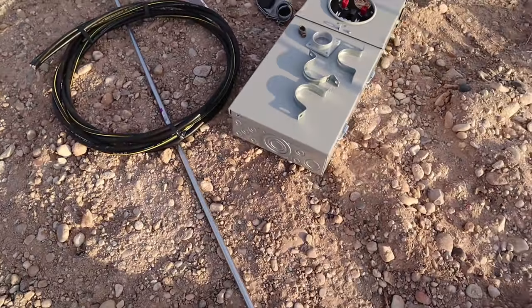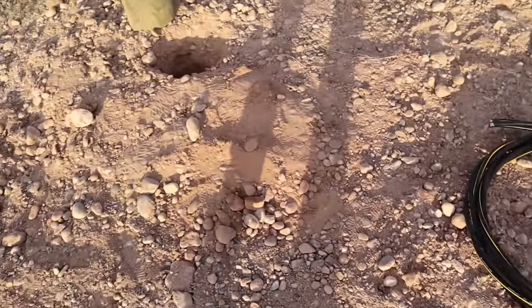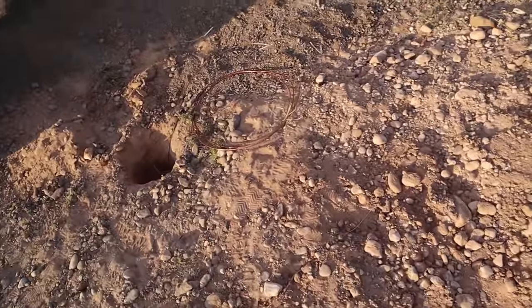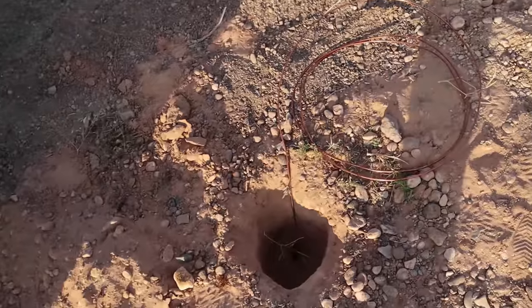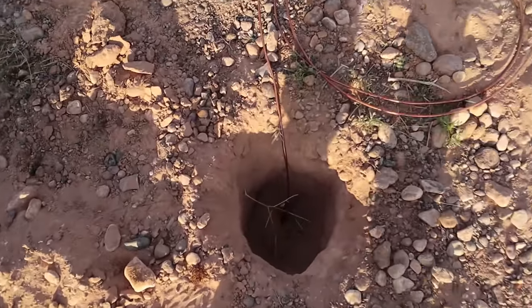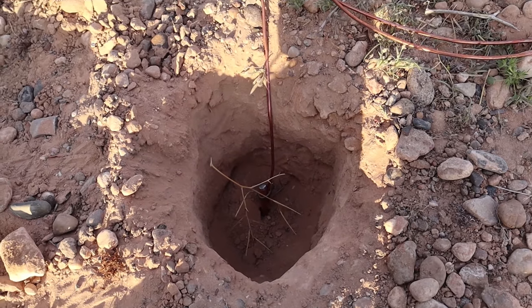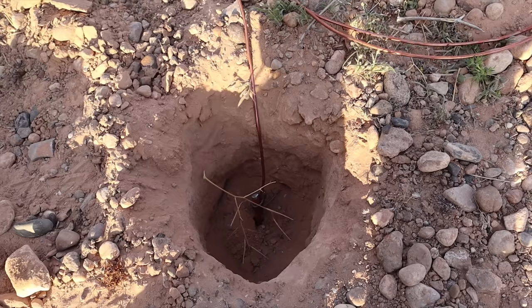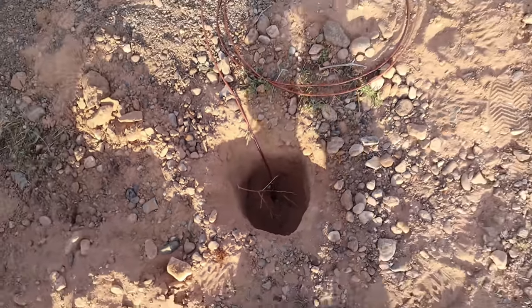This EMT right here comes out the bottom of the box with your ground cable. I actually drove these ground rods into the dirt yesterday — they are a 5/8-inch diameter pipe and they are 8 feet long. We drove those in with a 20-pound sledgehammer standing off the back of the tailgate of the truck because of the height of the pipe at 8 feet above ground.